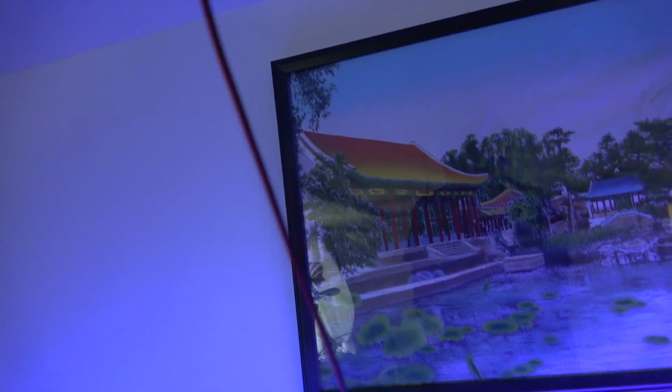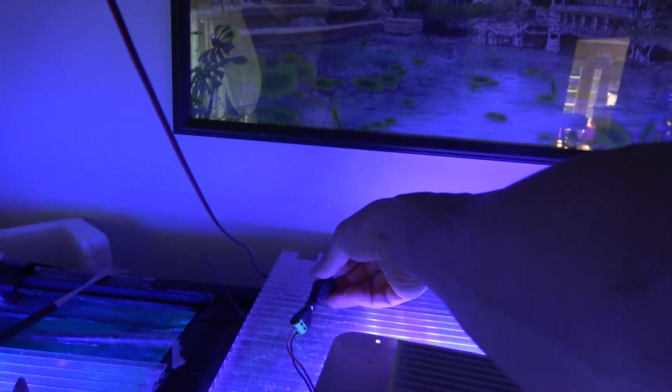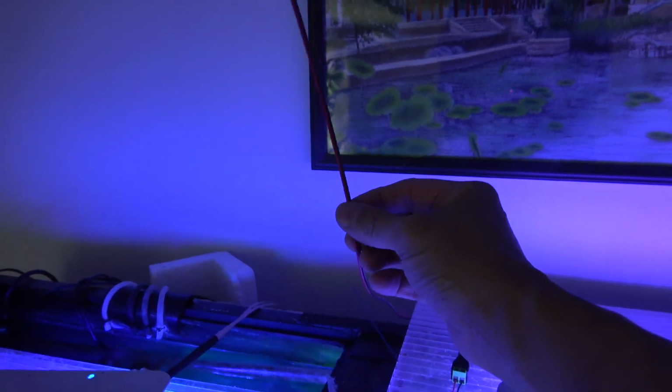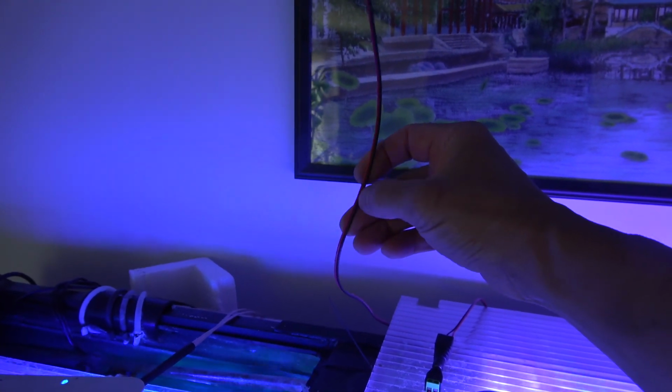So I'm getting ready to split the solar panel light that comes down. And what I'm going to do is cut it somewhere down there, and then I'm going to splice three connectors off of that. One going here, and then one going to the other panel, and then one coming over to this LED panel. And when you're cutting this wire, look how it's tightly together, right? They're not separate wires. If I go ahead and cut this right now, that solar panel is supplying direct current